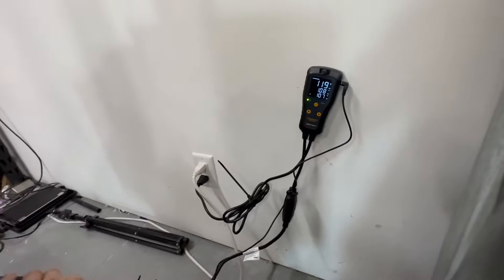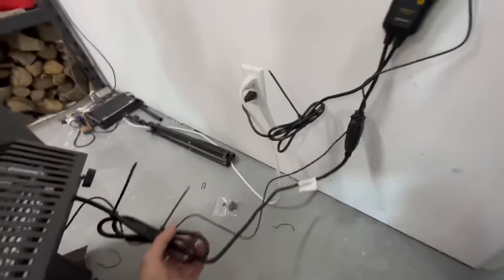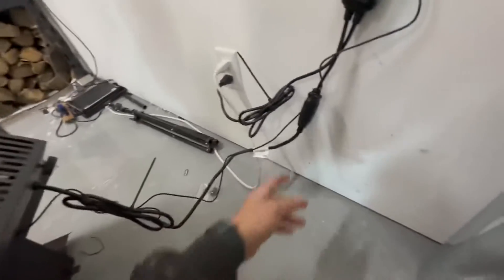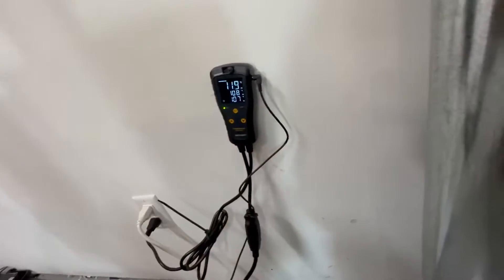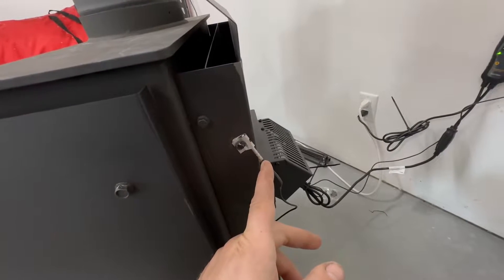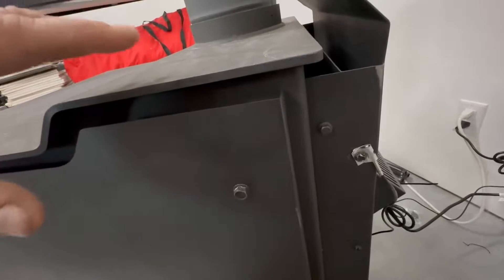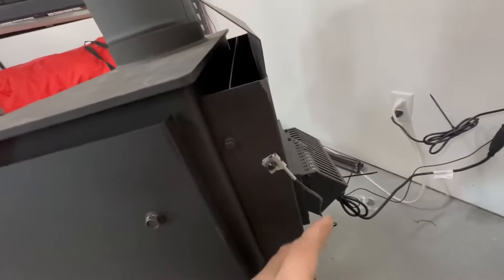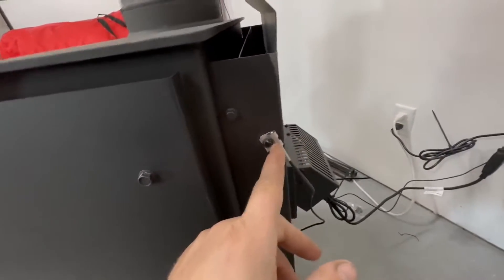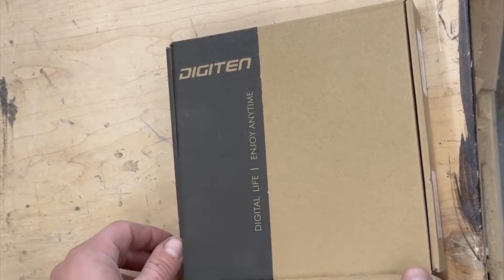I'm going to turn this off so you can hear. It's plugged into the outlet here, and then my fan plugs into this, which plugs into the thermostat. The thermostat wire runs around and I picked a spot on the outside shroud of my fireplace. This is rated for about 250 degrees, so you don't want to stick it right against the metal because the outer jacket of the fireplace can exceed 500–600 degrees. I mounted it on the outside of the shroud — not inside where the fan is moving air and cooling it down too quickly.